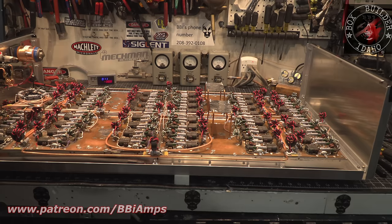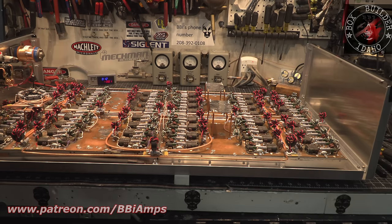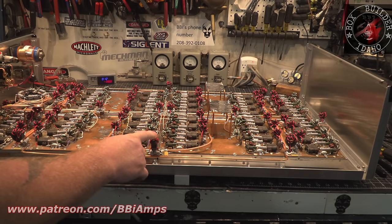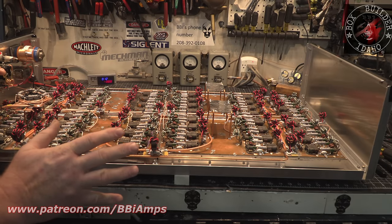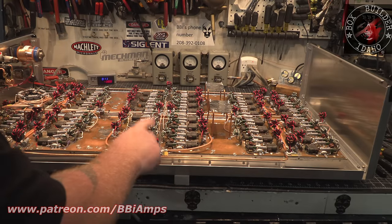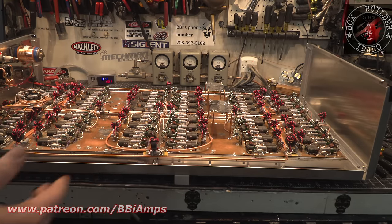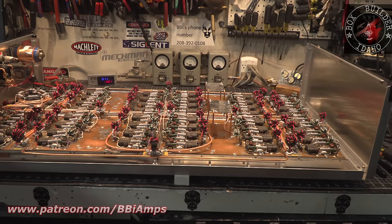Now, the reason for that is, well, 8 pill, 8 pill, 16 pills. We're going to ask this combiner to hold roughly about 2,000-ish bird, 4,000-ish peak. That combiner will easily do the job, and we're going a total of 3.5-4 feet with it. The coax is going to heat, but it's not going to heat enough to where it's going to fail. It's not going to heat enough to where it's going to cause a significant loss in power.